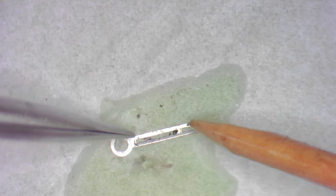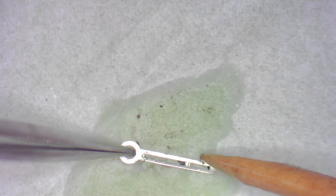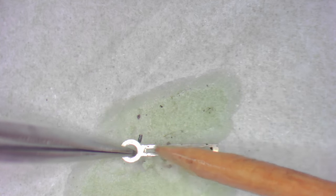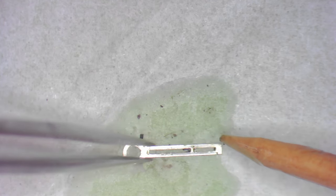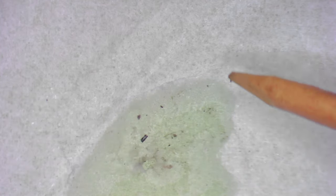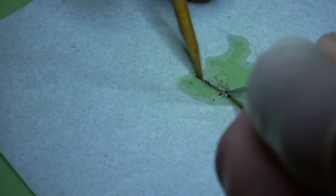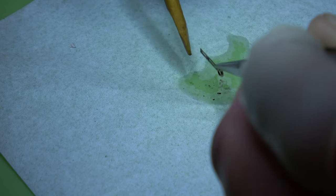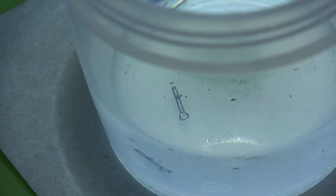But with the dial on, let's look to the hands. So I've had them soaking in some isopropyl alcohol. That seems to have taken care of the lume, gotten rid of it. And then we'll just scrape off the remaining paint. And we'll rinse it off again in the isopropyl alcohol. As you can see, the bits at the bottom there, it's left.